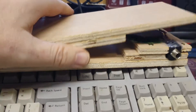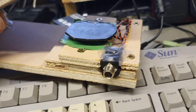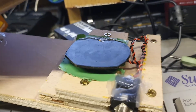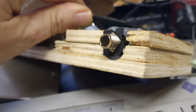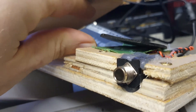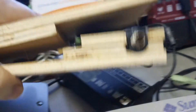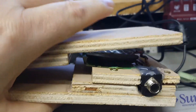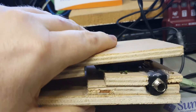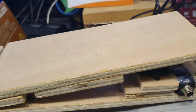So what is it? Well, it's a standard quarter-inch jack. I like to wrap the wires, and inside is a bit of neoprene just to act as a buffer, some hot glue, and one of these little piezo electric discs. I've made it so that it sort of shuts down like that, and the act of bashing there is what makes the signal.